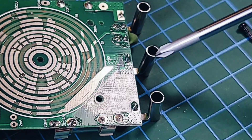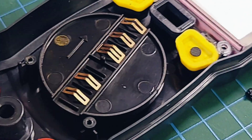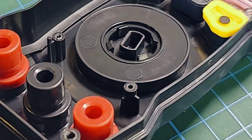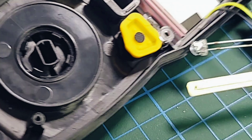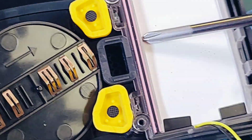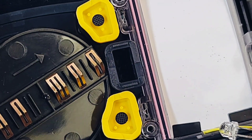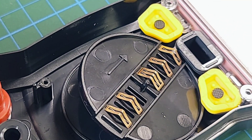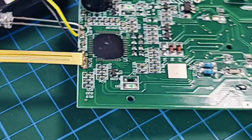If you take a look at those input jack soldering jobs — yeah, I like what I see. On the other end we have five pads — that's what makes contact with the selector tracks. And look at that rotary selector switch — kind of cool because the ball mechanism is actually inside the plastic. It's definitely a ball bearing mechanism but I like the way they've hidden the springs and balls from getting lost in transit. Nice soft-touch buttons over here. Zebra Elastomer for the display — and that is about it. Also, the display itself has a plastic housing with an old white strip — just a little bit better than having it flopping around the meter. All in all, pretty decent — we're in the cheapo realm. I've seen a lot worse.